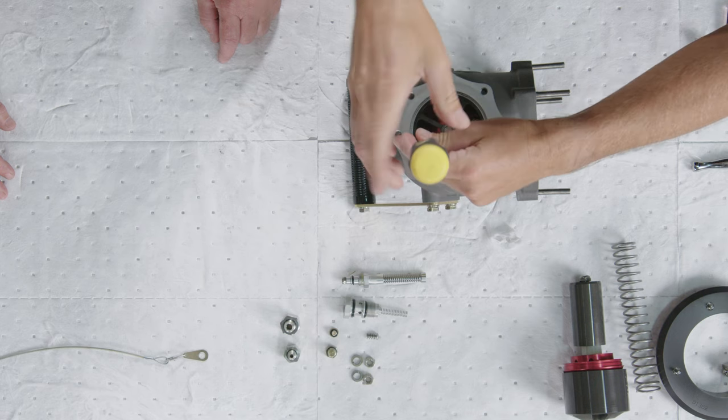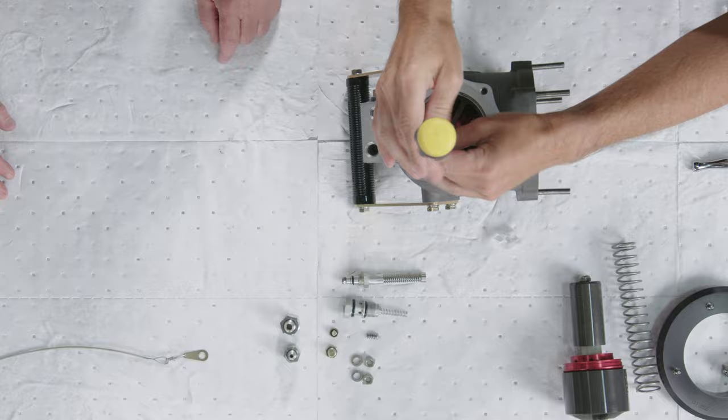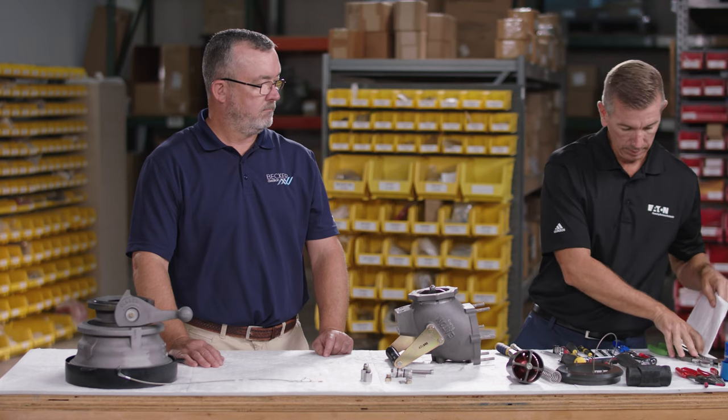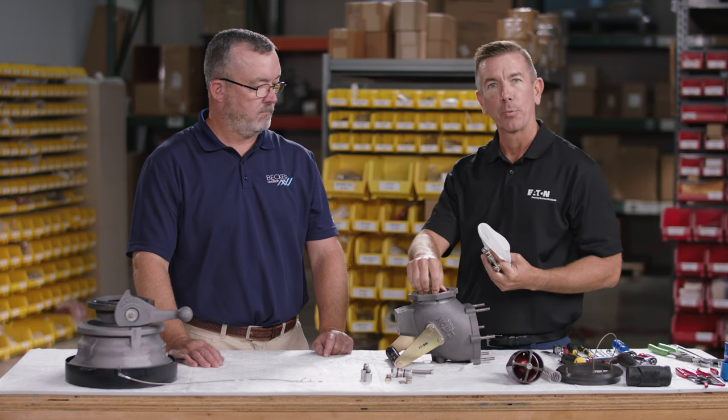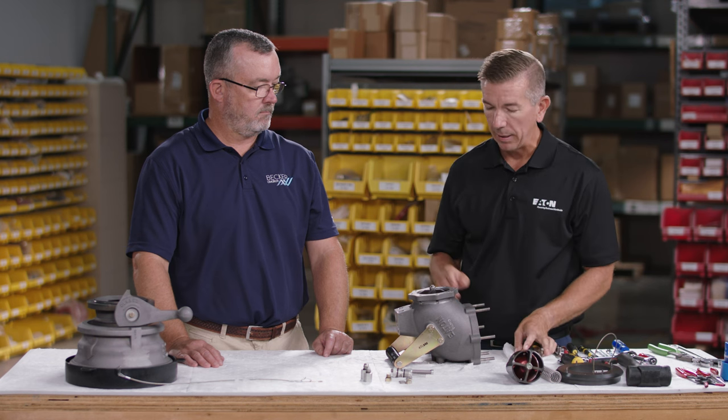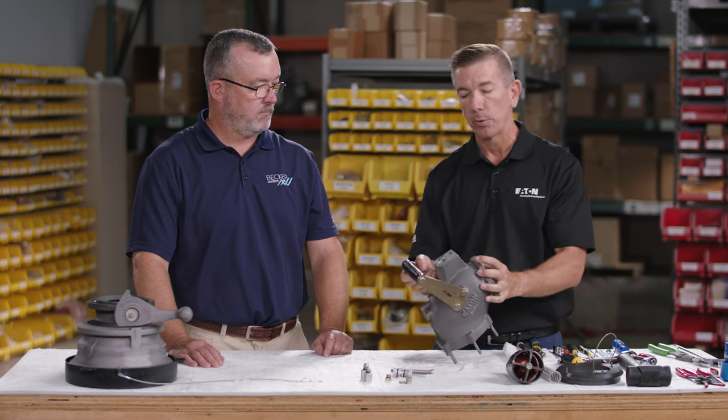You don't need to completely remove these screws — just back them out until they're all completely loose. To remove the main piston, use a set of vice grips with a pad to protect the ribs. Note that we removed the bleed ports first because fuel can be trapped behind the piston, creating a hydraulic lock. By removing the bleed ports, we relieve that pressure so the piston can be pulled out more easily.